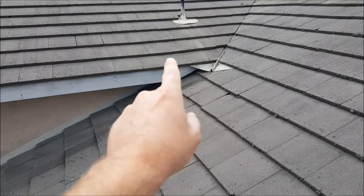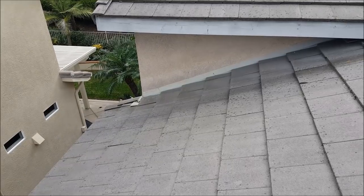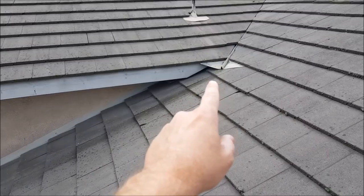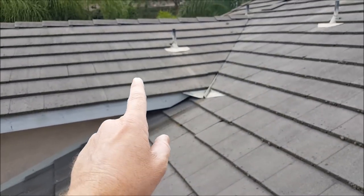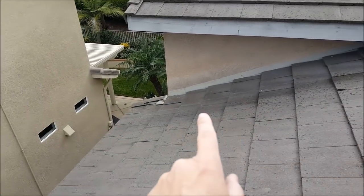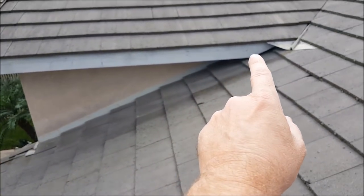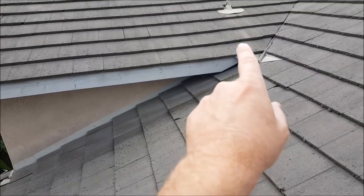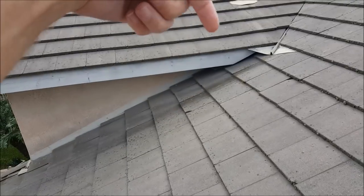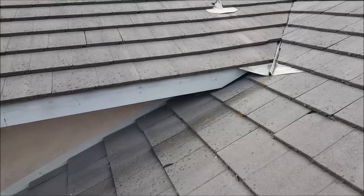Most likely the issue starts up here, and that's what you'll have to take apart. Whenever you get a roof leak under a valley, the valley is probably the problem. You'll have to remove tiles all the way around, get the valley piece out, remove tiles down to here, get the metal out — and don't let the roofer leave the tile panning. You have to take out the valley metal, the felt, and the eave boards so you can look straight down and properly finish the tin run.